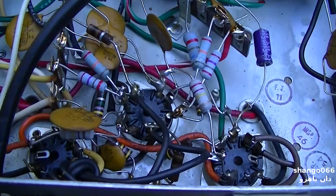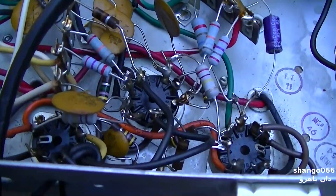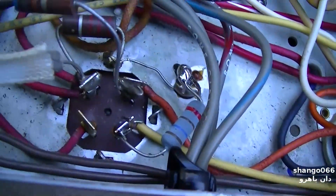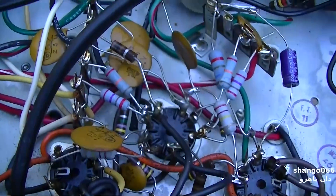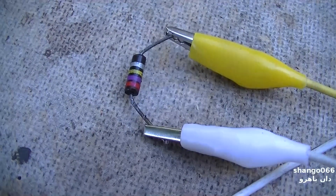All of the resistors have been changed. This 100 ohm is just filament drain. I even changed this capacitor. The two cathode resistors have been changed, and we'll go through and see how far off they were. I'll start with this one — it's a 270k. This was the culprit why one channel was dead.